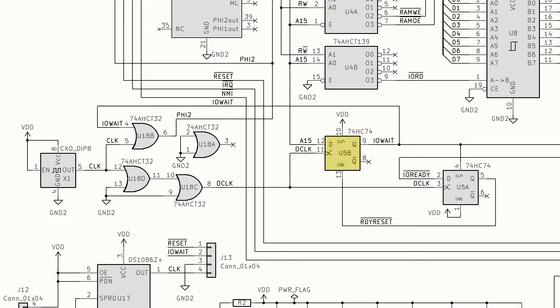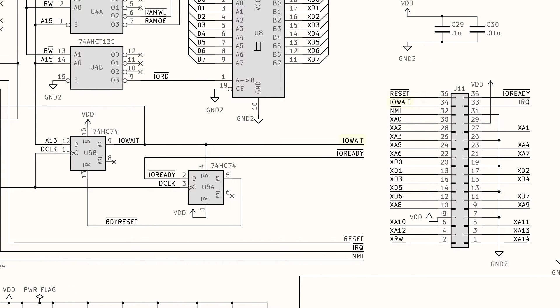The crystal oscillator can go low and high many times in the meantime, but the actual CPU clock will remain high until we've finished the IO operation. This is carefully timed so that this D flip-flop is only set or cleared while the raw clock input is already high, because we don't want to set or clear this when the clock was low — that could cause really small runt pulses on the clock which could upset the CPU. So this D flip-flop's clock input comes straight from the signal which feeds PHY2, slightly delayed through a couple of OR gates. This IO wait signal goes off to a separate module — the IO module — which includes the IO subsystem and the ROM. The IO module uses its own clock oscillator at a slower rate, and it contains the circuitry necessary to pick up this IO wait signal and serve a regular bus cycle to produce the right value on the data bus during a read operation, or to write the value from the data bus to whichever device was selected during a write operation.